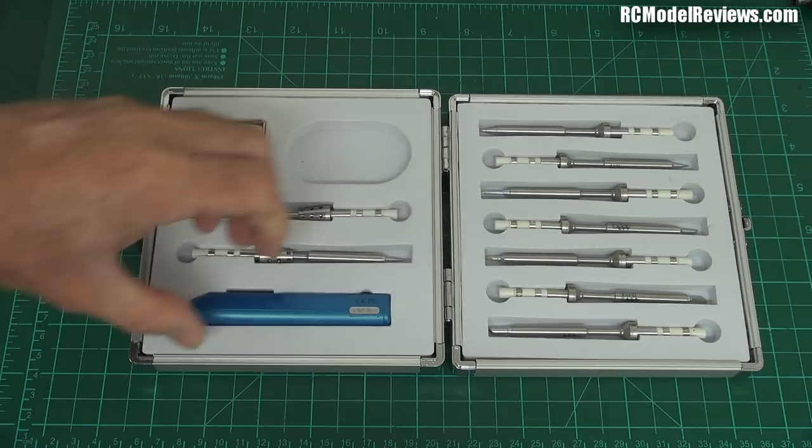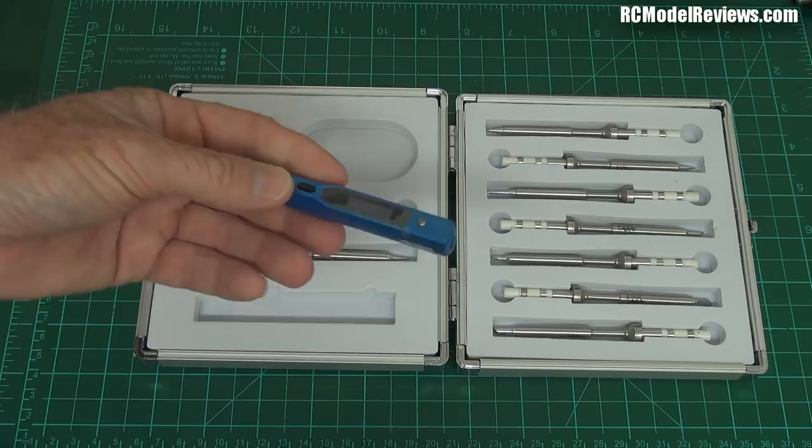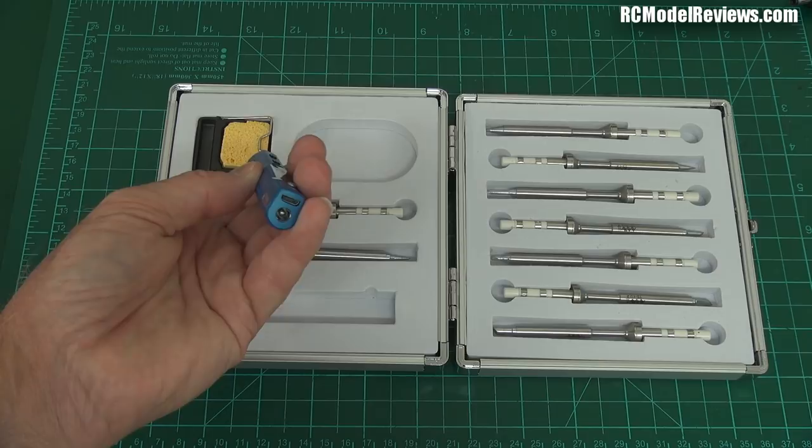This is the cornerstone, this is the heart — the intelligent controller, the handpiece. There's a 32-bit microcontroller in there. It has an OLED display and buttons. It's not your ordinary soldering iron. It's actually an intelligent soldering iron, and it is open source, so you can actually reprogram it through the micro USB on the end there.